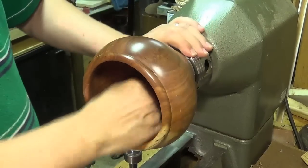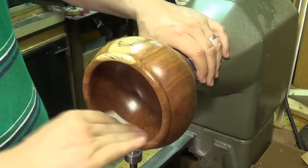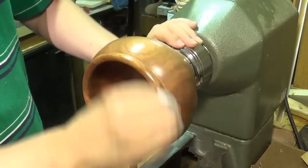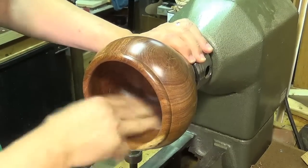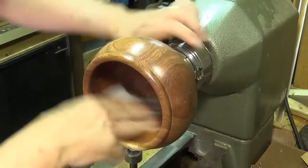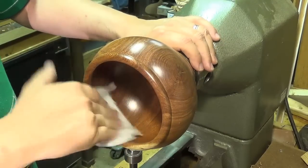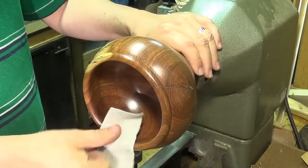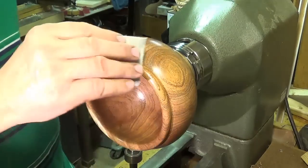It was about 91 today, and so I put this vessel out in the sun for about 3 or 4 hours, and I think that really helps because it hardens up the polyurethane, cures and seals everything up really well and gets rid of all of the excessive what they call aromatics. Those are the petroleum distillates and things that evaporate. And that little bit of heat helps it evaporate even quicker and gets it out from way down in the wood. So I'll let that set overnight, and I think I'm done.